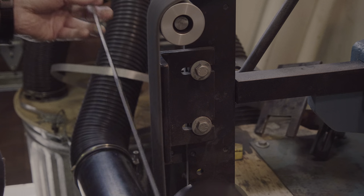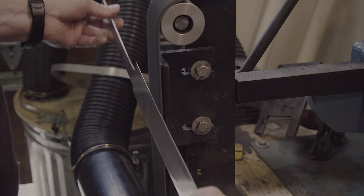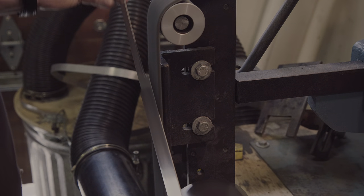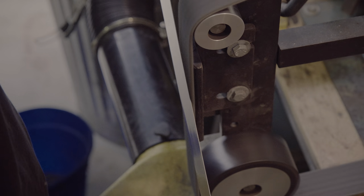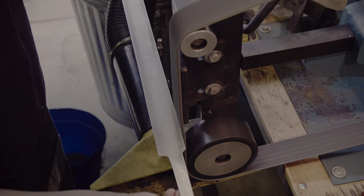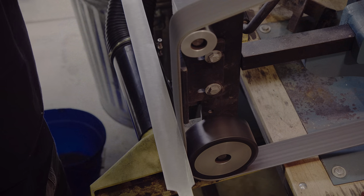Fixing in this case means going to a different belt, as the scotch-brite belt does not really remove a lot of material. During the last stages of working on the grinder, I prefer to check frequently as etching in ferric chloride has a tendency to accentuate any imperfections.